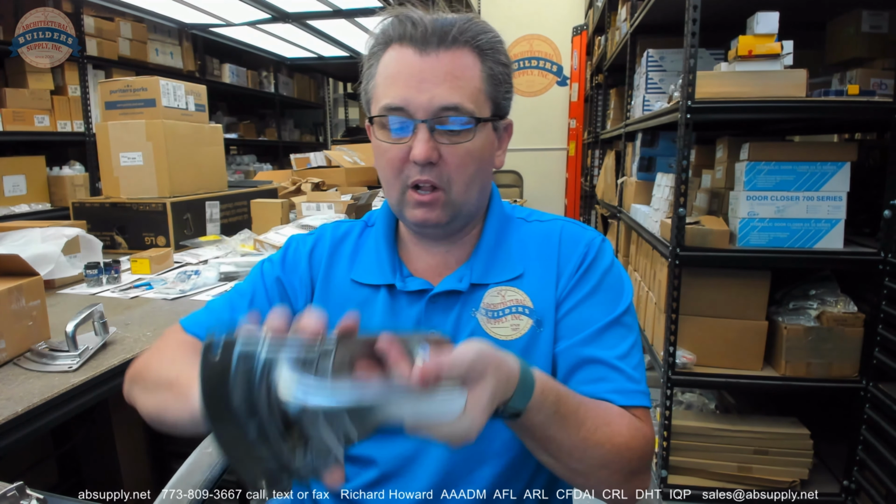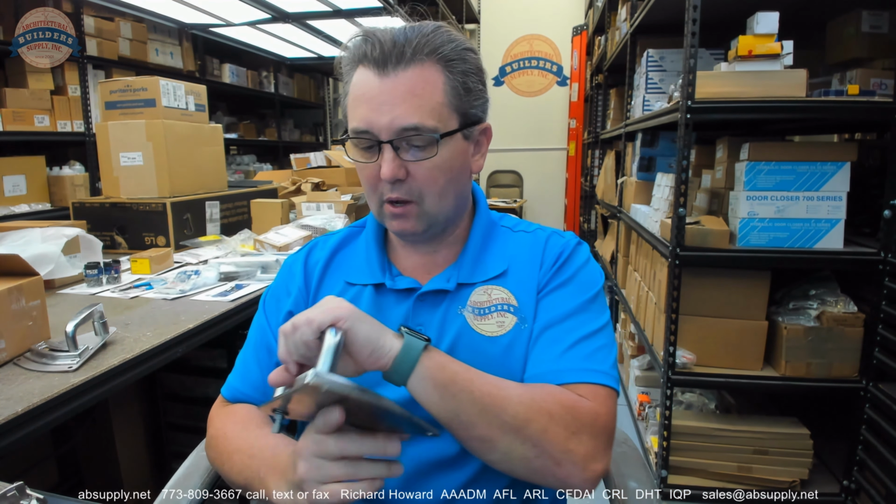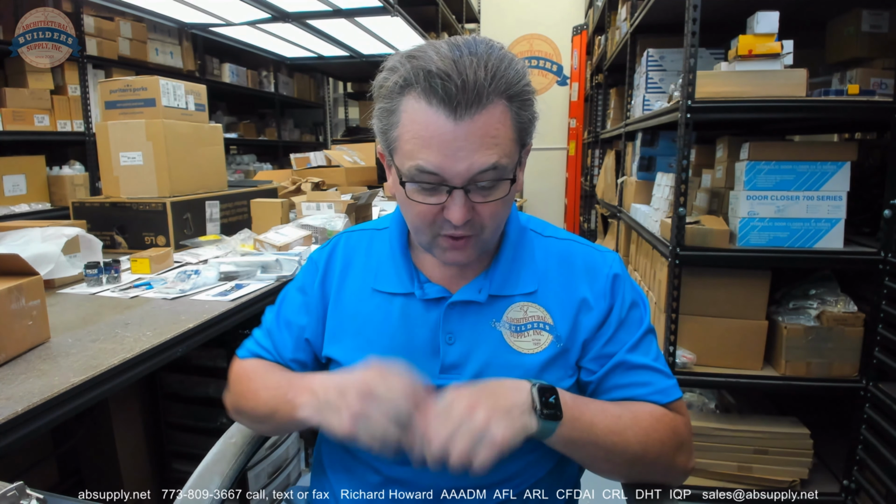Okay, really neat. So the purpose of the video is to talk about RR Brink in general, how to go about servicing that material, and what the LE Eskort trim looks like. Clearly they're handed. They have to know what hand you're dealing with on the lock. I cannot detect inside or outside, and as a result, ordering the material according to the hand required for the opening is the only way to order hardware. But this client ordered two, a left and a right, and I cannot detect the difference between them. I'm quite comfortable in saying there really is no difference, because there seem to be no different parts for the exterior side.